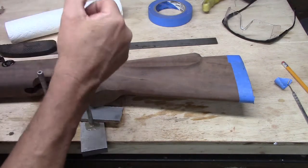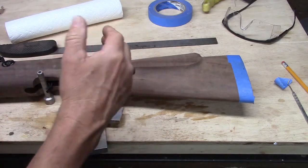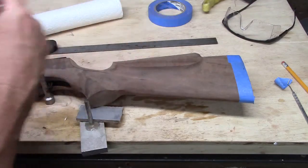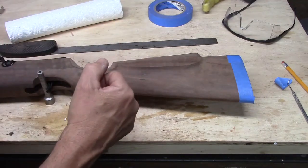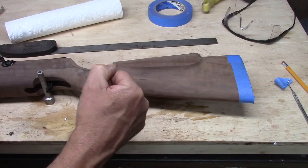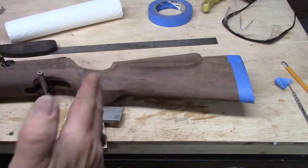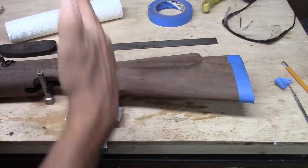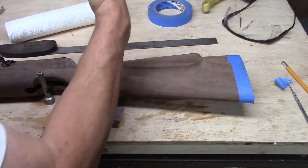And then when I make the cut, I make sure that I don't put any sideways force on it, because there is a little bit of flex, right? Certainly if you really put some force on it, you can flex it quite a bit. Sometimes when I make a cut on something, I'll flex it away from the work while the blade spins down. It has just a tiny bit of flex. So I want to make sure that all my force is just linear, and I don't bury the saw in the wood and then cut.